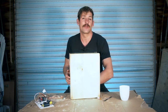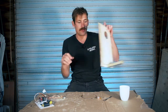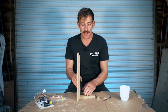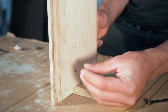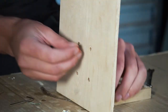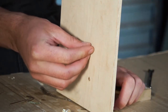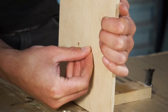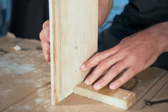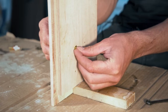We've got to install terminals from the outside while using a hand on the inside — you won't be able to see what I'm doing, so I'm going to use a piece of back panel glued to a bit of MDF to show you what happens on the inside. The first step: get your clear washer, put it onto the centrepiece and make sure it locks on, then get your top hat and place it into the hole in the back. If it's a little tight, lightly tap it in with a hammer. Then get your threaded rod and clear washer.